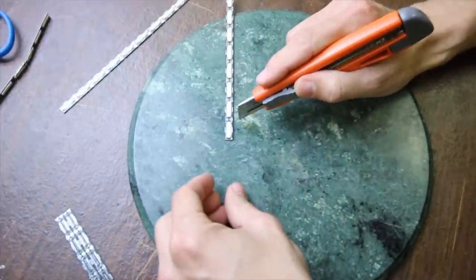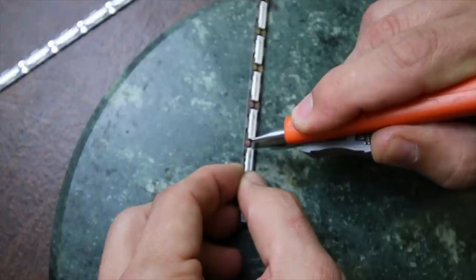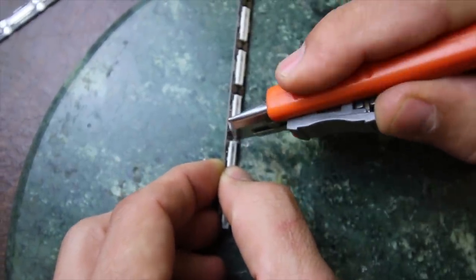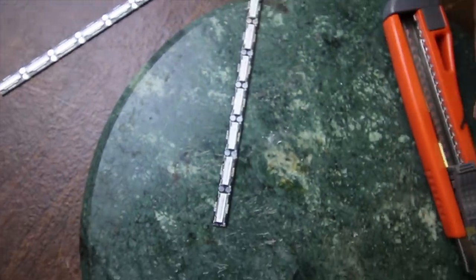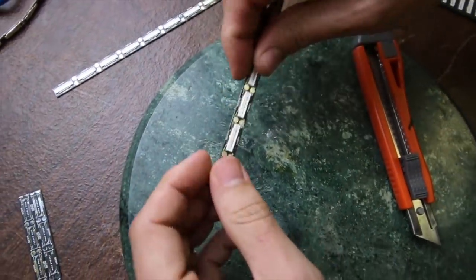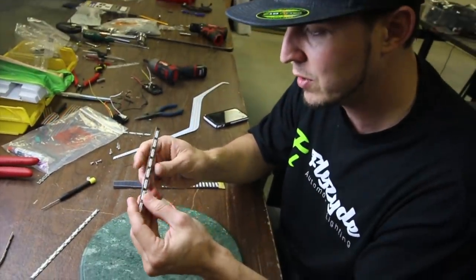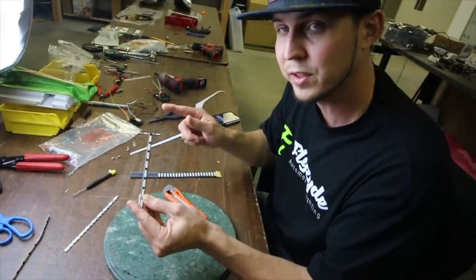To do it we're going to use the box cutter. I'm just going after the first pair of LEDs and chopping right through it. Alternatively you can do this before you have the LEDs in place — cut through the circuit board with a Dremel and slice them up however you need. In this case I want to show you the whole process, so I'm going to go through and every two LEDs make a slice through that circuit. Then we'll test them to make sure only two LEDs turn on each time we move the ground wire connection.